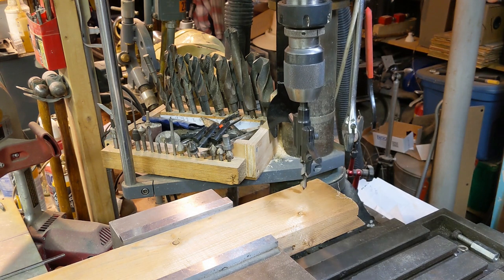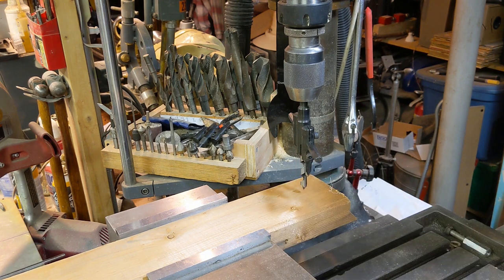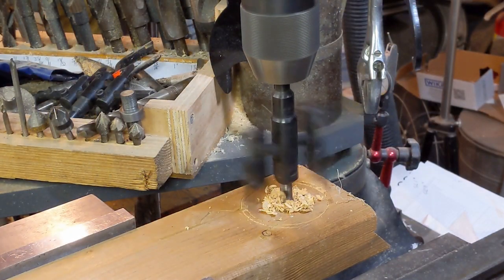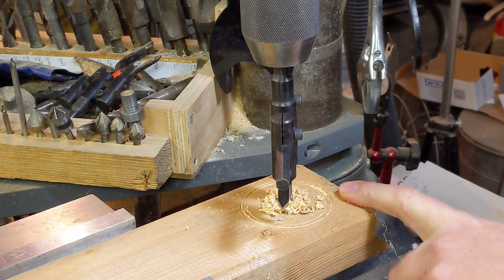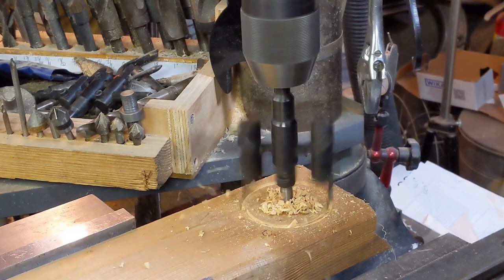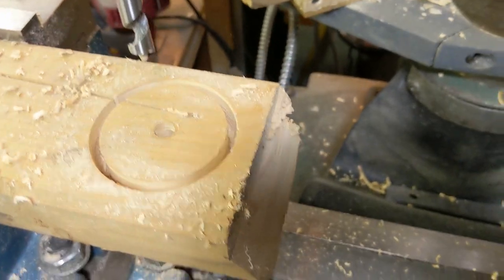A 2x4 is not necessarily the ideal test bin but it's certainly adequate. We'll cut to whatever depth we get — more or less halfway through — and stop and take a look. You can see the kerf it's creating. I have a wider kerf than is probably strictly necessary, but as long as there's something to clear the chips out of the way, that's fine. At full depth we have nice clean cuts on the walls, and it didn't have any trouble at all clearing the chips.